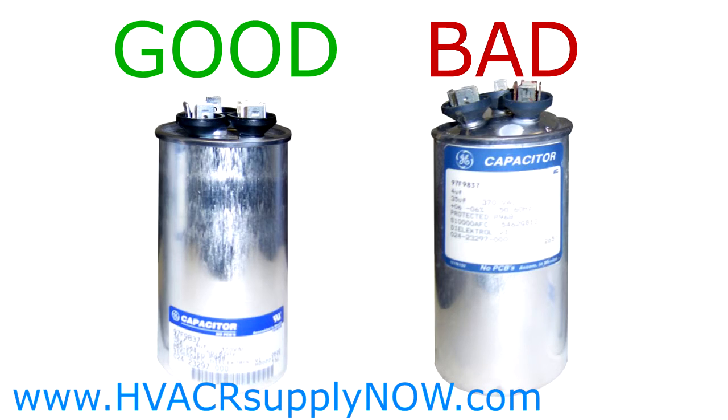As you can see in the picture, if you remove the capacitor or look at the capacitor and you see the bulge, that's a clear indication that the capacitor is no good. What happens is inside the capacitor it will overheat, and as the capacitor overheats it'll expand or bulge on the top. There are wires that connect to the plates inside the capacitor and they will break as the capacitor bulges. So if you see a capacitor that has a clear bulge on the top, the capacitor is definitely no good. There's no need to test it at this point — you'll need to replace it.